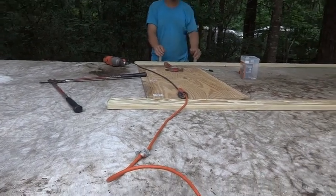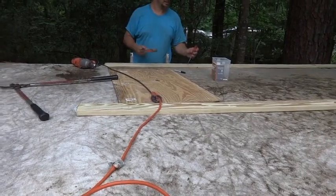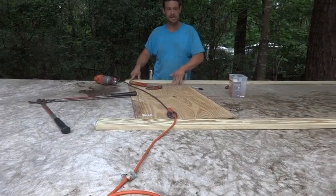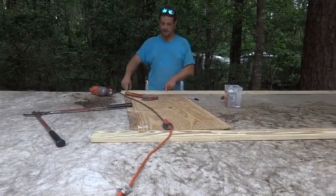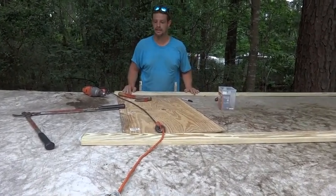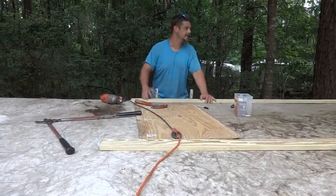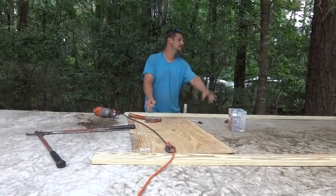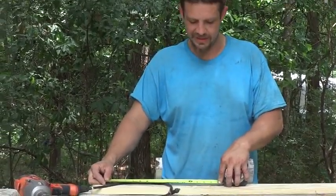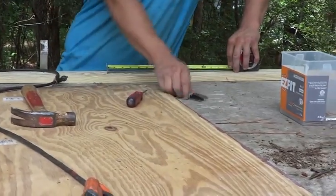Finding something solid is a little difficult — you've got to use a hammer and punch to look around. If you get your first one, take a tape measure, go sixteen inches from there and you should have another stud. Looks like we've got fifteen-inch centers here — we'll go from here and see if we've got another one right there.